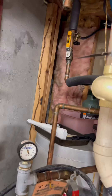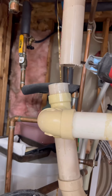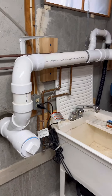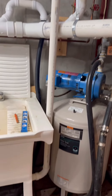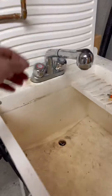So this is the future vent and it's gonna get tied back into the drain — we're gonna cut this sucker off right here and then tie it back in. You'll notice that the future vent drops down to the pump because the pump won't turn on without that, and I didn't feel safe just tying it into the pump and not the sanitary system as well for the drip back.